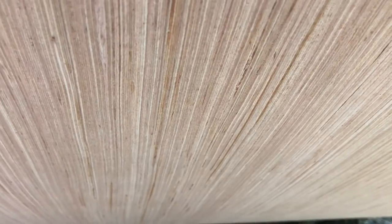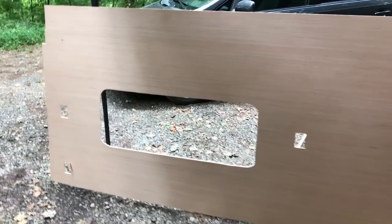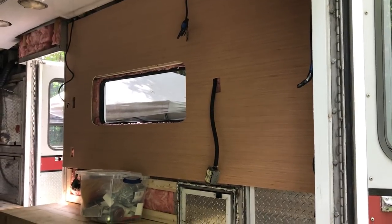There's the finished piece. On the other side you can see that nice wood grain — I did a clear coat on this for a previous van build and really liked it. The edge on the outside is nice and clean. Here's the before with the old board, and here is the new one. Let's put it inside and see how it fits — not bad, pretty happy with that. Working with the template was extremely helpful. There's extra length that doesn't quite reach the end of the wall, but it terminates in front of a door so I can cut it back. There's a little gap at the top, and the wires are making it bulge, so I'll probably have to build something out there — which will also be helpful for running wires later.